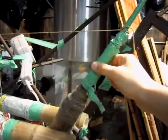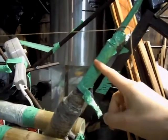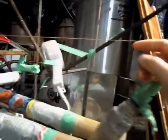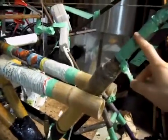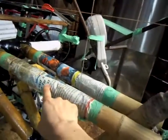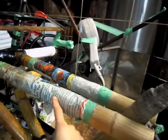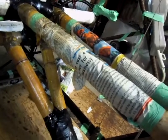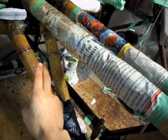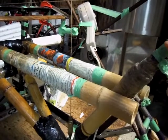So I'm going from the lowest position that the seat can reasonably be, which is about here, and then I'm doing an arc measured from the end of his knee to his groin, his crotch, his inseam, and I'm taking that length, the radius being out to here, and then the arc being along here, bearing in mind the position his shin might be in. The pedal is doing its stroke, and it's quite far forward. Anyway, yeah, that's going to be one of the next things.